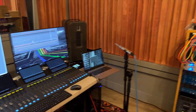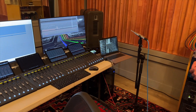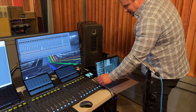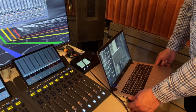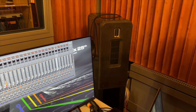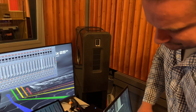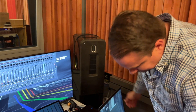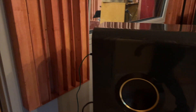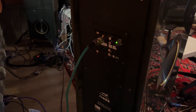So now we're going to go ahead and implement some filters. I've already done my measurements. We're actually using a tool that someone had developed — the guys at Hypex Electronics. So I'm just going to enter in some parametric EQ. Getting the monitors fairly flat within this room wasn't that hard. And you can come around to the back and see these are the custom Hypex modules that Chris and Chet put in that has the DSP.